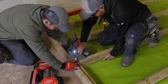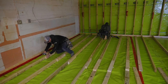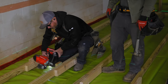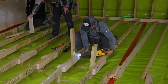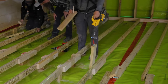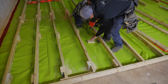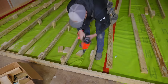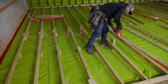Once we had a few joists set in place, we started leveling them by lining them up with the line laser. To keep each joist at the correct height, we nailed on a pressure-treated foot that both set the height and supported the joist, letting them run long and cutting them off with a reciprocating saw — much faster than trying to cut and match the floor angle. The span from the center feet to the edges of the platform was more than seven-and-a-half feet, so we added more rows of feet — one towards the front edge and another between those first two rows, plus two more rows towards the back half — keeping the span under five feet in any given spot, making the platform rock solid.